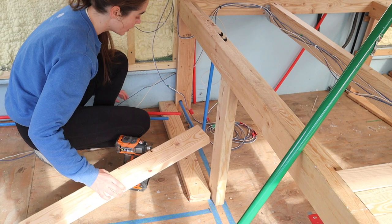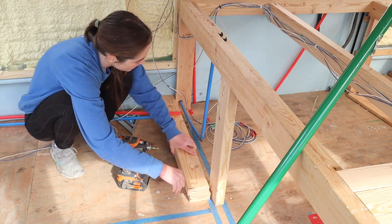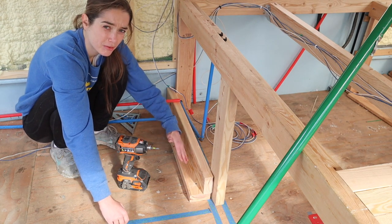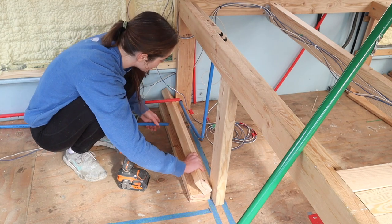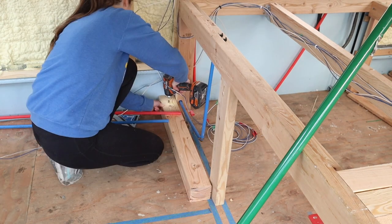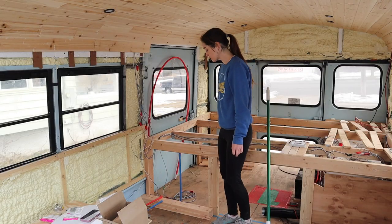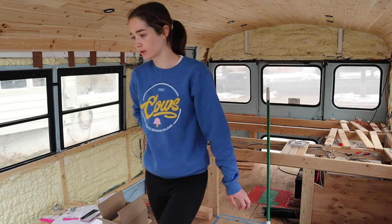I'm going to stack two on this one because this is right where the shower is. I think I might need it to be this tall so that I can waterproof it. I'm not sure, it might not need to be that tall. But I'm just going to do this just in case I do need it. Next thing I'm going to do is put an up-and-down piece from the corner here up to the ceiling. I'll just measure that - 66 and three quarters.